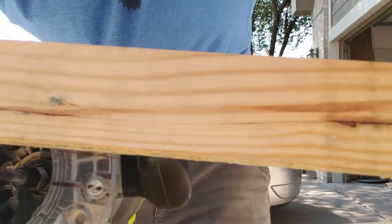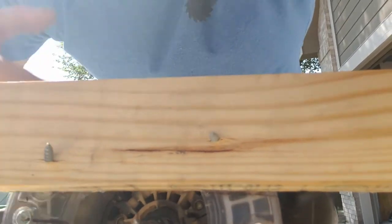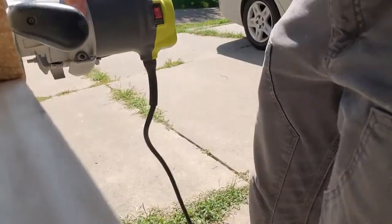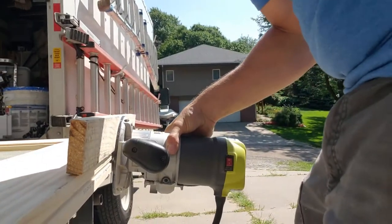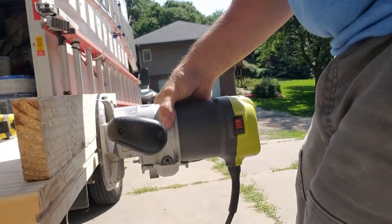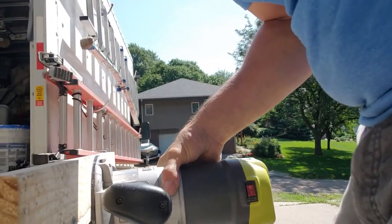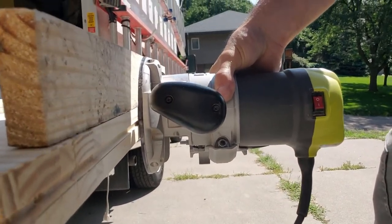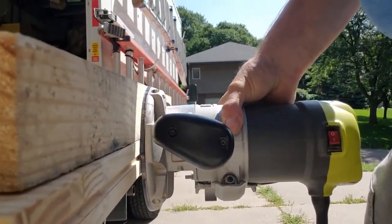Right there — it's screwed into the back of it. These screws won't interfere with anything. What this allows me to do is use that board as a guide, and it just rides along the door putting a perfectly straight groove in it.